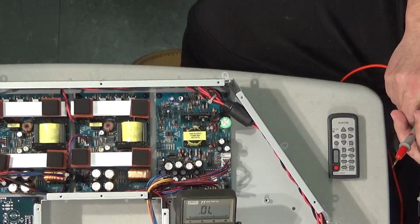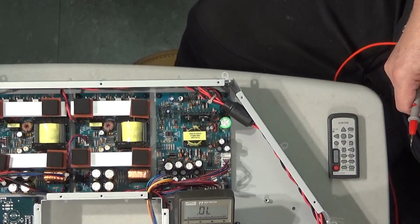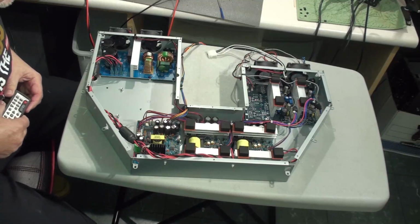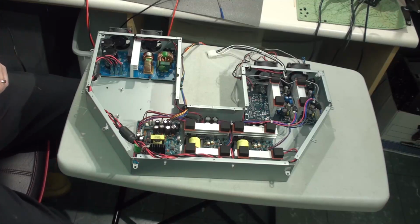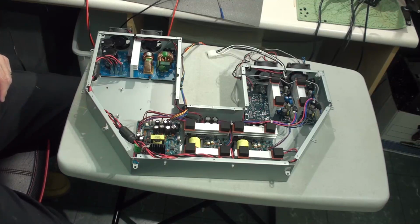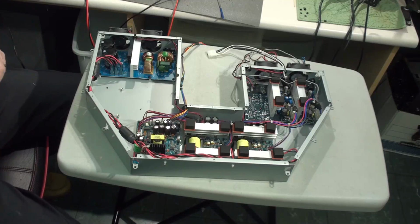I think I'm going to take that board out anyway and test that diode out of the circuit. Okay, so I have removed that auxiliary power supply board. That's the one right here. And I looked at the bottom of the board. I didn't see any burnt spots or anything. I checked that